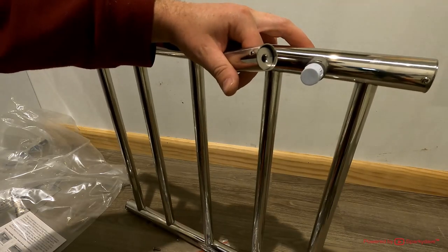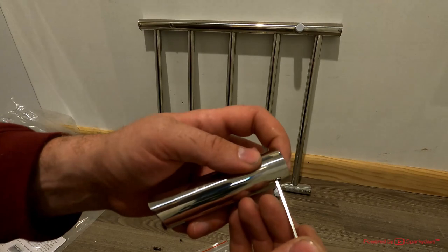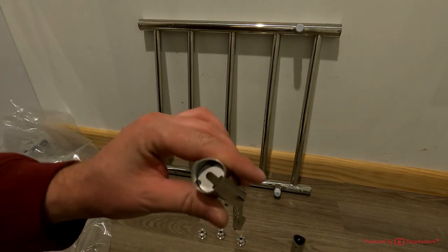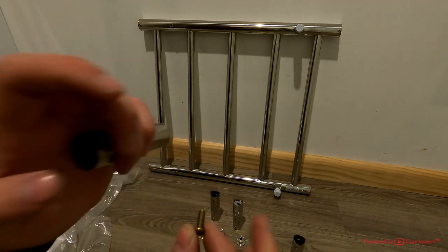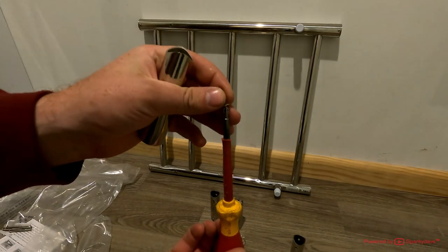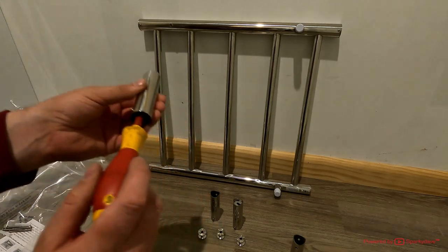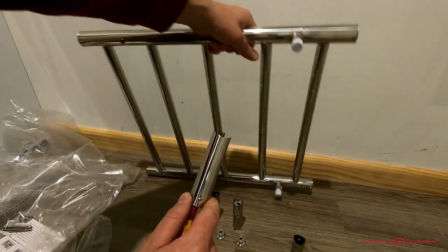So instead, we'll have the powered leg at the top of the towel rail, though it may look unsightly with an allen key sticking out the top — we'll work around that. There should be an allen key provided with each towel rail. Take out the wall fixing mounts by popping the allen key in, untwisting a bit, and they'll pop out. To attach the feet, put the screw through and screw into the towel rail. An easy way to do that is to invert your screwdriver, place the screw on top, then place it on carefully.